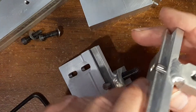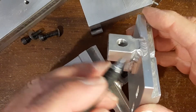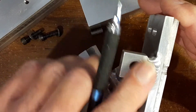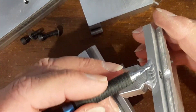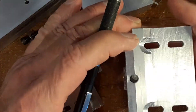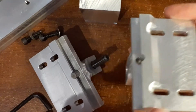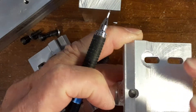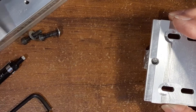I took a quarter inch end mill and just drove it in there — you could drive it in as far as you want, you could put a slot across the whole thing. I thought about that at first but that's a waste of time; all you had to do is go in there just enough for clearance for that dowel pin. As far as the front of it, I had it overhanging so that he could put a weld on here. I didn't have to clean that up — I just took a cut to clean it, ran the tap in with a flat surface to go on. If you had a wider piece — I'll call this the base — you could take this angle piece and move it back and make another one.